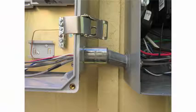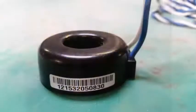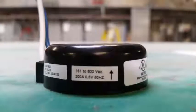Create a protected route using conduit for the CT wires from the main load center to the Envoy S. Use only the production CT that came with the Envoy S. This is important because the CT is paired and calibrated to the Envoy at the factory. The production CT is also marked with the same serial number as the Envoy S. Locate the arrow on the CT label — when the CT is installed, the arrow needs to be facing toward the loads.